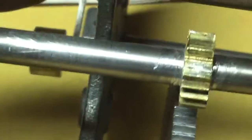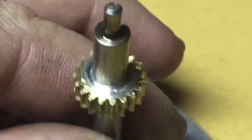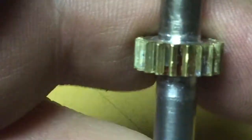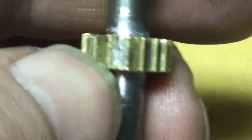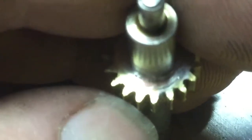I think this is going to be functional. I've already had both of these gears in together to check the mesh to make sure everything would be okay, and I'm quite happy with that. You can see that chamfer is very nicely filled in — same thing on the chamfer here. While this was still mounted in the lathe I turned it down and then dressed it with a file. You can see a little bit of stray solder that got into some of these teeth — there's where the crack is, with solder in there. The gear teeth look like they're spaced out wider there, but they're not really — it meshes real nice and smooth.